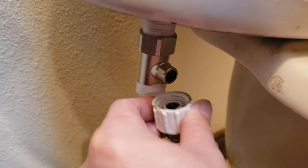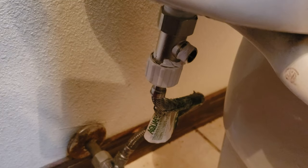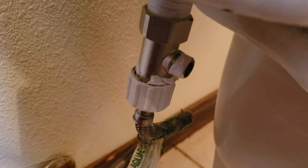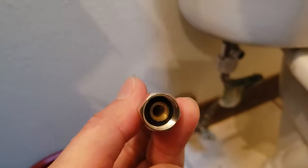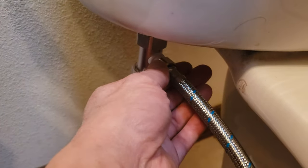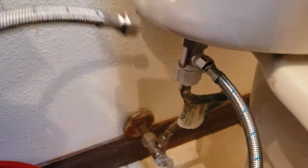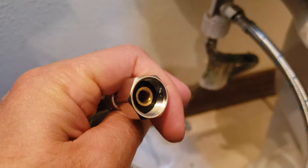The T-valve is on and I added some plumber's tape. Now I'm going to connect it to the cold water hose and screw that on tight. The main cold water hose is on and I put the plumber's tape on the threads on both ends. Now I'm going to connect the bidet to the T-valve using the extension pipe — the washer is already inside. The smaller end goes in here, righty-tighty to tighten it, and the bigger end will connect to the bidet control unit.